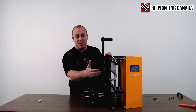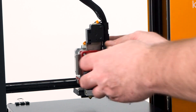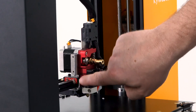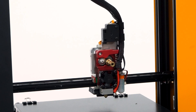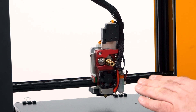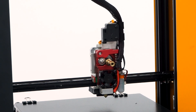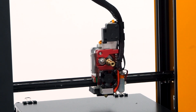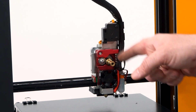They also used a MakerBase 32-bit board, which is another wonderful feature. Looking under the hood of the hotend, it has a unique extruder — this extruder is also your heat sink. It doesn't have an all-metal heat break in it, which is the only thing it's lacking. Most printers don't come with all-metal heat breaks; it's typically an upgrade. Upon closer inspection, it looks like we might be able to work in a Kraken all-metal heat break, so you'd still get that all-metal functionality. They also included a filament run-out sensor, and I love the wheel on the extruder gear so you can manually feed filament in.